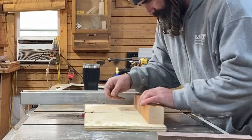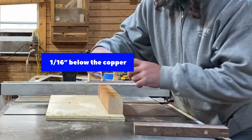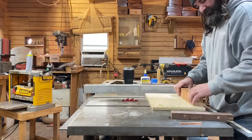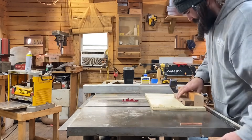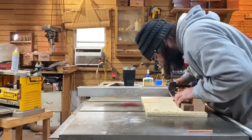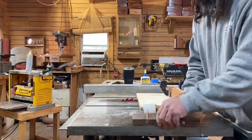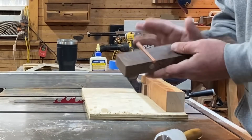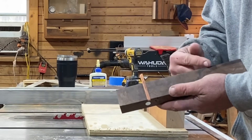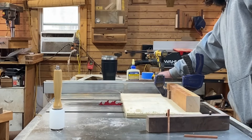So we'll take our miter sled here and get our blade height set right about a sixteenth below our copper. I'm gonna add a soft little chamfer right on the edge of our copper. But first let's go ahead and get our slots cut out. Make sure to mark with your copper the slot you want to cut and just cut right inside of those lines. So we got our first inlay cut — and that is a perfect snug fit. I'm just gonna cut this one slot first, get it assembled, and see if I want to go ahead with the next one. I think I might just stay with one of them, but we'll find out real quick.